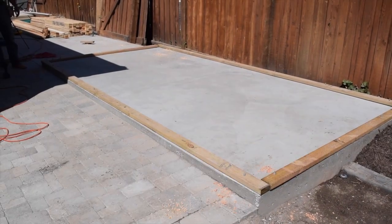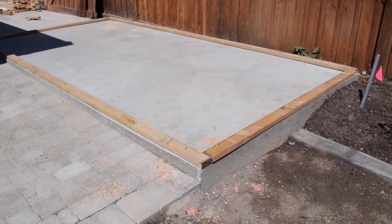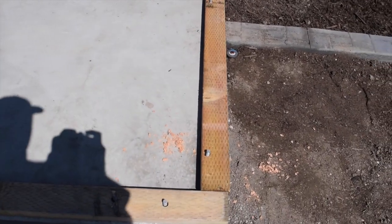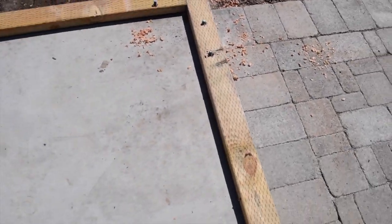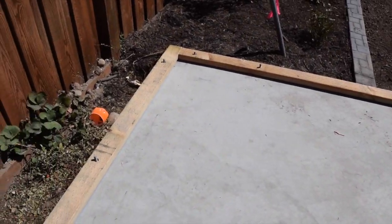The slab will almost always be a bit out of square, so we can't assume that we can measure off the concrete edges. So we will measure off one edge and make a line and create all the other marks square from this first line.